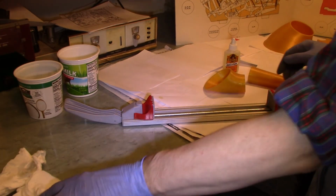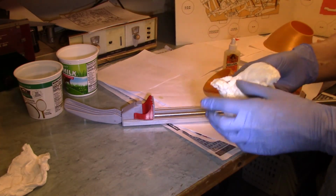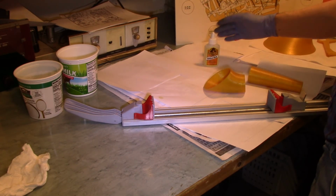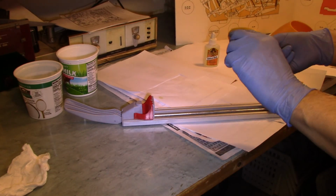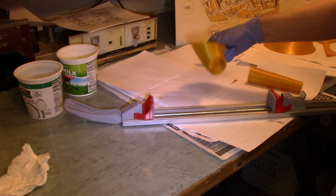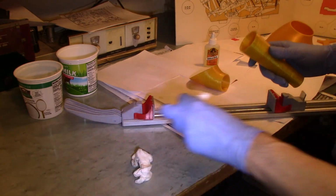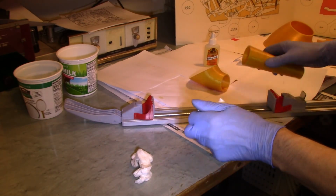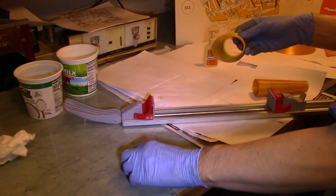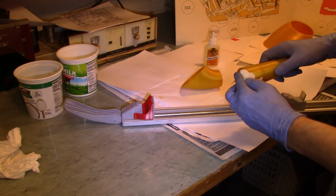Okay, sanding and all good stuff. I'm about ready to clean my surfaces. And the nice thing about this particular glue that I use, Gorilla Glue, I don't know if it's really all that particularly great. With a name like Gorilla, it's got to be pretty strong, right? Just the fact that it's a water-activated adhesive means it has the advantage that I can get that last little bit of dust off by cleaning it a little bit with some water, in effect. So the biggest thing is to make certain I don't have any lint from the parts.